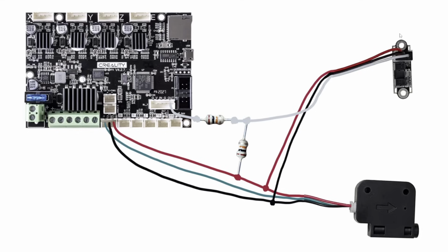And then the other one is an inline resistor, and you need both of those for the system to work. And like I said, make sure right up here on this switch that you get those wires connected correctly, that red is going to voltage and black is going to your ground. And on the back side of this switch, there's some screen printed letters which will tell you which wires are which. So don't just rely on my diagram for that. Make sure you're looking at the actual switch.